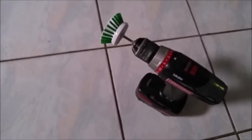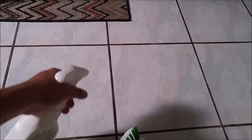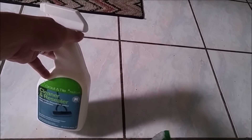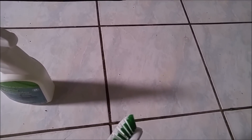Now let's put it to the ultimate test. When it comes to cleaning your grout, there's usually industrial strength stuff you can use, or professional grade, or there's stuff you can buy from your big box hardware store. This one's a cleaner and resealer. Just put that on there, follow the instructions — the instructions say to spray directly on the soiled area and leave it several minutes if it's really caked on there. Since this is a high traffic area that leads to my kitchen, I sprayed some on there and I'm going to leave it on for several minutes.